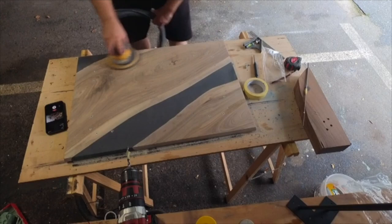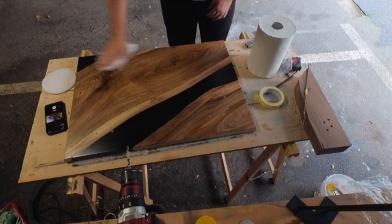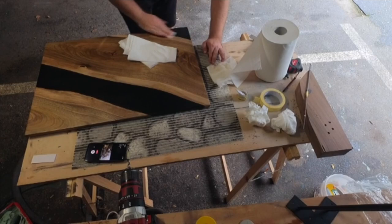Everything is ready to be finished now. On the bottom side, we used a food-safe oil finish that is durable, but not as durable as the Odie's Oil that we used on the upper side. If you're from Europe, you can find the link down below for Odie's Oil. They have really great customer service — they didn't sponsor this video in any way, but I really like their product. You simply wipe the finish on and, after some time, wipe it off. After three days, the item will be fully cured and ready for use.